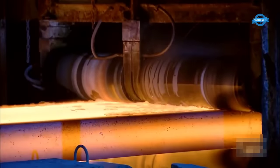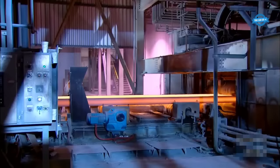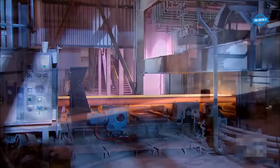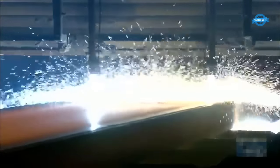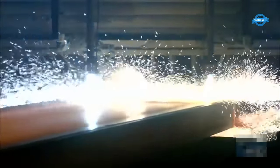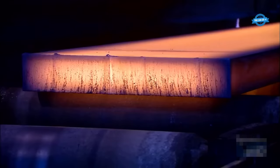Next, the bubbling steel soup is poured out of the furnace and passed through rollers to form a long strip measuring 70 meters in length. A special torch cuts the flat rolled blanks, and each blank is marked by a steelworker using a hot pencil on the glowing metal. The blanks are then transferred to another section for further processing.